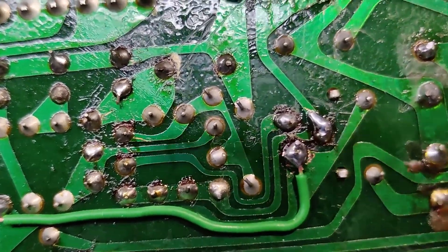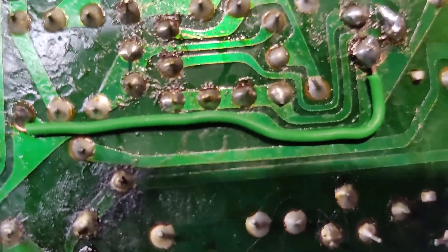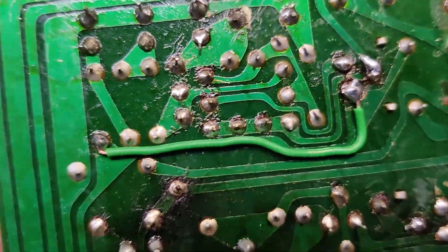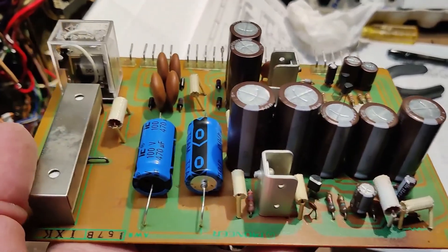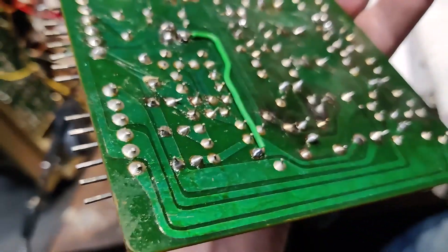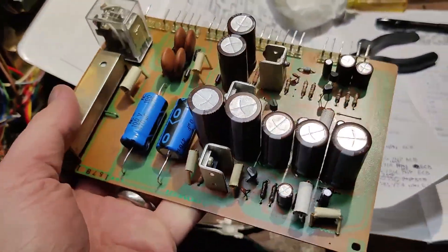On Q5, one pad was completely lifted and barely making contact, so I had to fabricate a trace off of the emitter leg of Q5 to a 2.2 ohm resistor R16, and that should do it just fine. I tried to keep the original trace, but coming along — just have a few more to replace and this should be good as new, it'll run better. I'd love to have a non-lifted trace but it's okay, it'll fly.